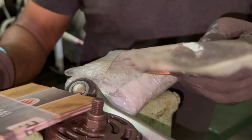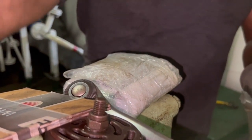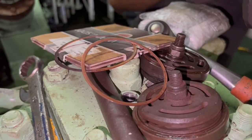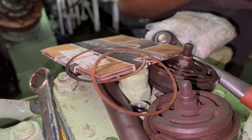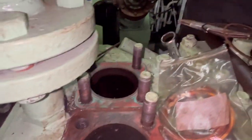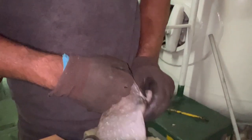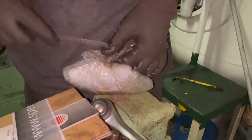The gasket cannot be used again, so I am taking a new gasket. Whenever you are using any spares for the compressor, always compare with the spare number so you do not misplace any spares with others. Some spares look very similar but minor changes will be there. Always check and confirm with the number so you don't fix the wrong part in place.